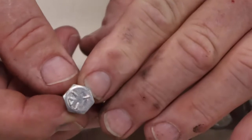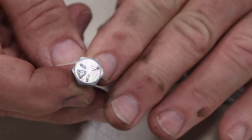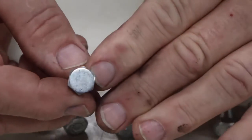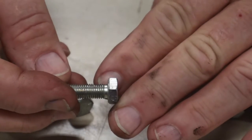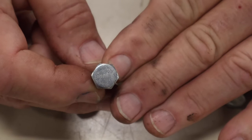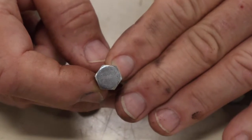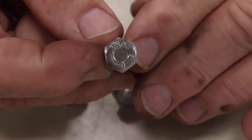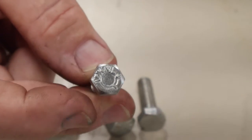Here's an American bolt. It does not have the circle in the middle — it just has the three hash marks. Three hash marks means it's a grade five bolt. Here's one with no markings on it, so that might have been a chrome bolt for decorative use, which aren't embossed and aren't grade five. Here's another shorter one — again, this says GKN or GSK at the top, with the circle and three hash marks on the outer circumference.